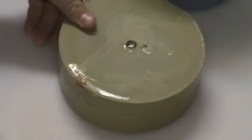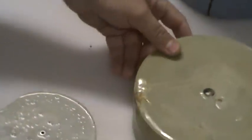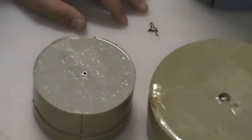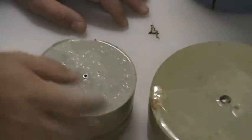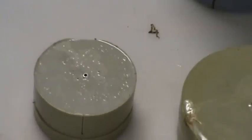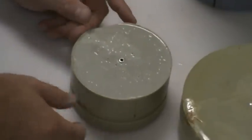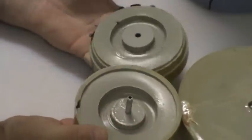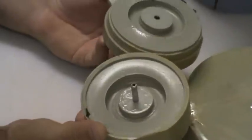Which brings me to the second set of molds. I did these for a guy down here in Florida for a dirt jet cougar. He sent me his original tires which are inflatable because he can never get the original ones to stay inflated, and he finally just got fed up with it. Using his original tires — I'm not going to go into the whole long process of how I used his tires; it took me forever to figure out and now, saying it would just confuse people — so using the original tires, I made these out of a urethane casting resin and they turned out a whole lot better. I was very very pleased with these.